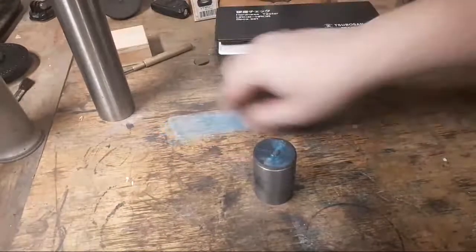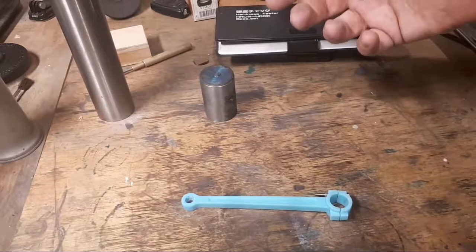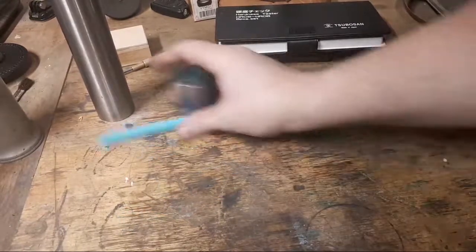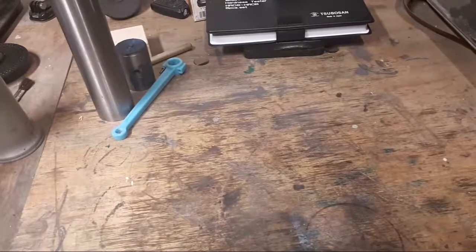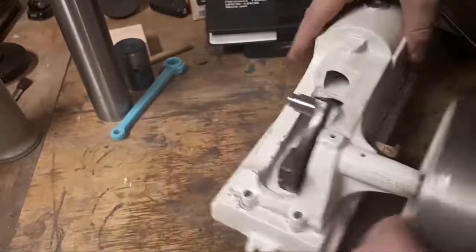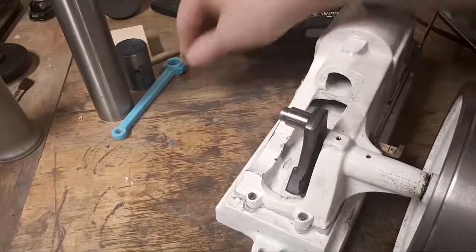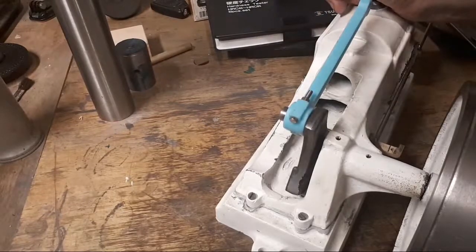I've had a bit of a stuff up. I've not read the drawing properly, somewhere between making patterns and doing the machining. I've not done a double take on the drawing and I've stuffed up. Let's get the engine over here and have a look. I put this bush on here and shrunk it on, which is 4140, which is a really nice job, and I'm really pleased about it. However, when I machined this, I didn't allow for a bush in the Conrod, and JB sent this, and we discovered that it's the same size without the bush as the Conrod is.